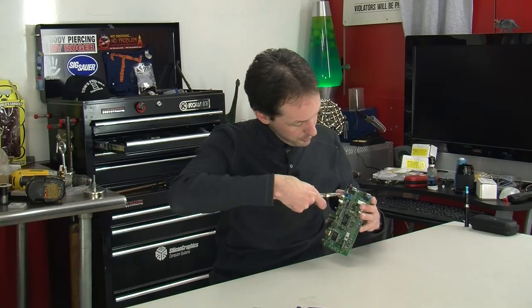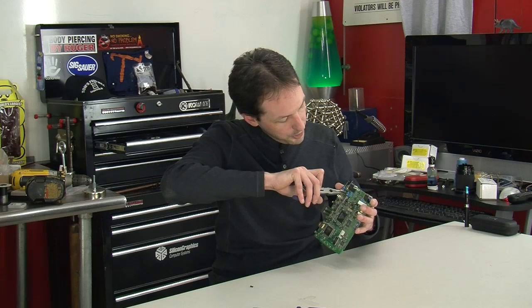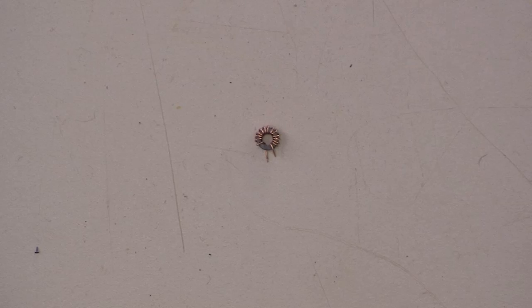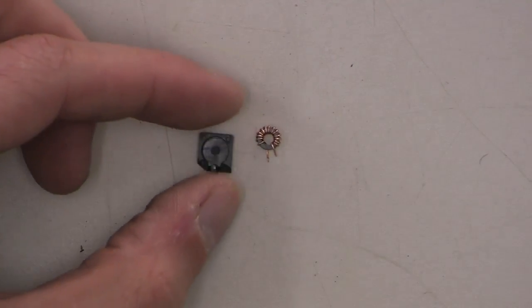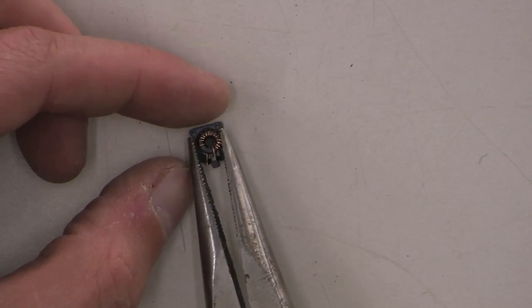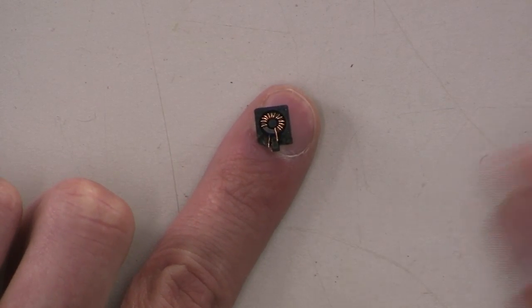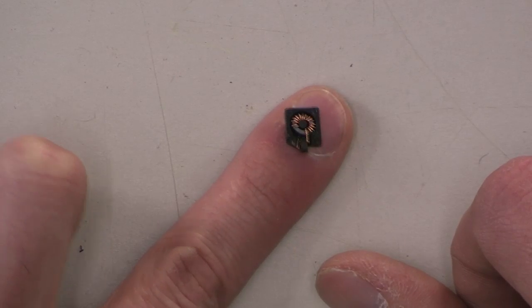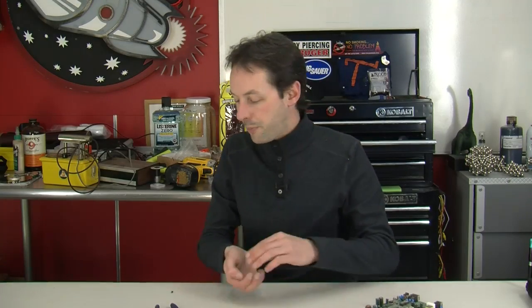This is neat - you don't see these very often. I like taking stuff apart and sharing it. Here's the inside little inductor - in a big case. Here's what it's supposed to look like: it's cute little tiny things, about as big as my fingernail. It's got hair-thin wire - that's got to be like 30 gauge or smaller - bare copper magnet wire wound on a little ferrite core. The cores that a lot of inductors are wound on are made out of ferrite, which is basically a powdered iron that they sinter into shape.